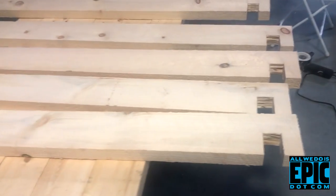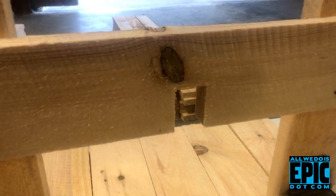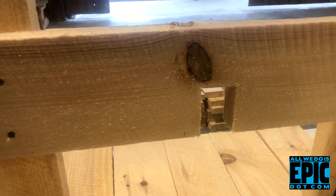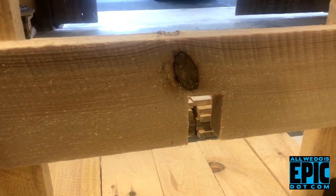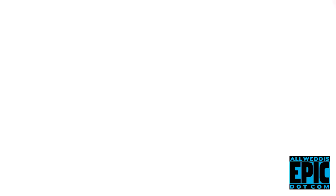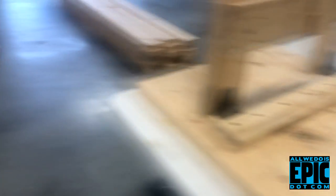Your cross pieces are 68 inches, and the notch is two inches in - it's a two-inch notch, just like this here. That's a 32-inch board, so you're notching the center at two inches; basically you're notching at 15 and 17 for a 16-inch center. It's very, very solid.